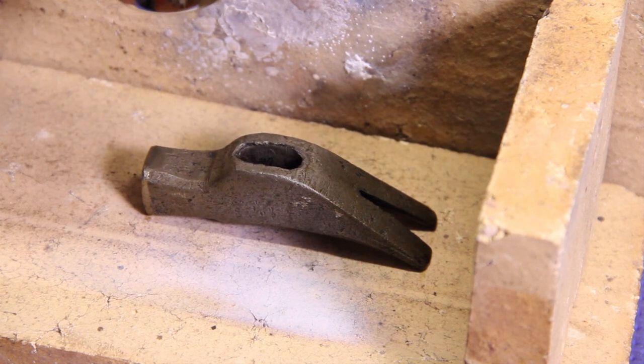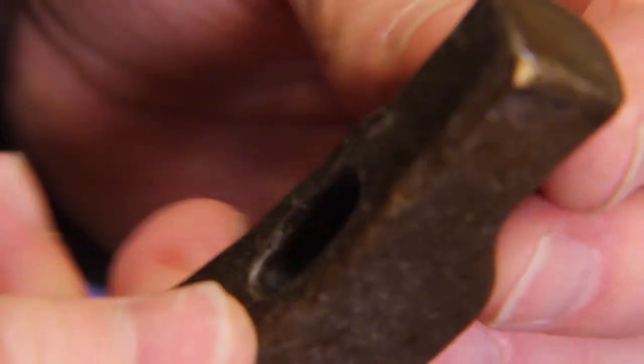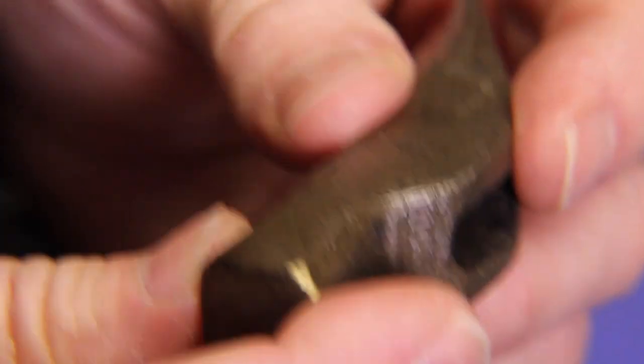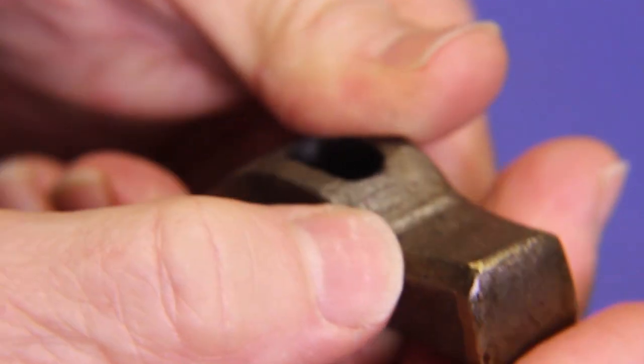It took a while, but it is slowly turning to a pale yellow, champagne color. Before testing the coating toughness I have to wait for it to cool down. The final result is pretty nice and it is really tough. The polymerization here took just five minutes — not much. I think this is a success and a very interesting result, because using the heat gun has noticeably accelerated the polymerization and actual hardening of the coating.